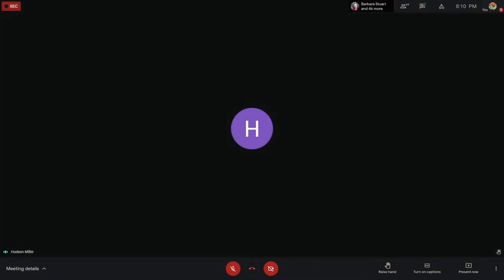Hi, this is Hudson, KE0FAN, and the question is, in a more traditional slot antenna that's fabricated in a sheet of metal, is it sensitive? Does it require space around it to work correctly, or could it be mounted just to the surface of a wall? Well, it's as with any antenna. Remember, it's analogous to a dipole. What happens if you bring a normal dipole against a wall? Is it going to work? Yes, it is going to work, but you're probably going to have to shorten it some. So with a slot, if you put a dielectric in the slot and not just air, you're going to need to shorten the slot a little or just move the matching bar down a little bit.